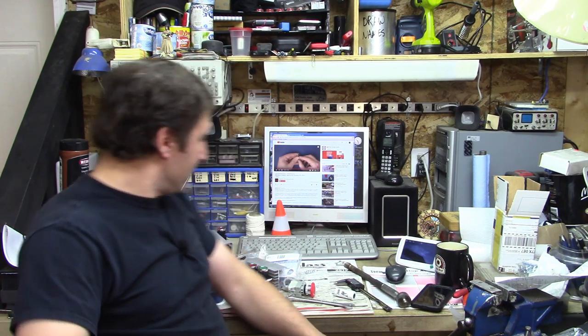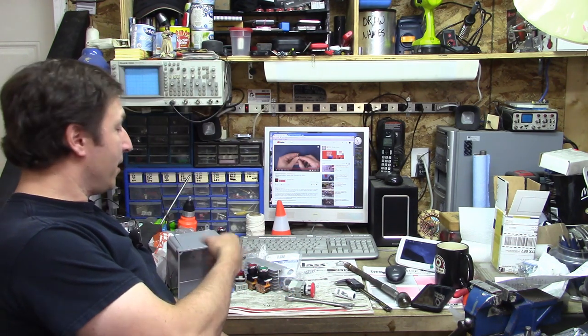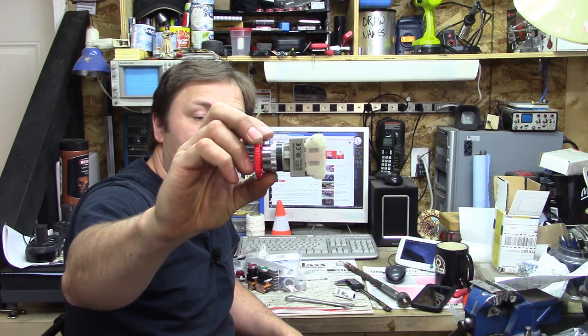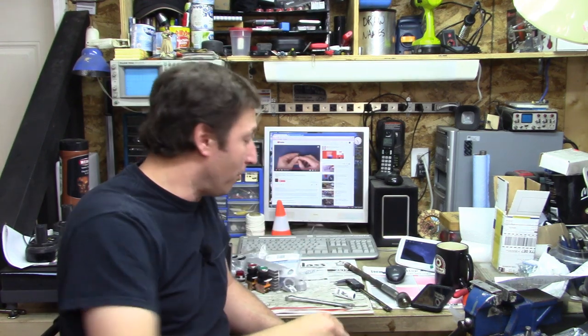What I need to do is drill some 7/8 inch holes in a plastic box. It's for the shaper — I've been getting around to finally working on the electrical system to put it together. All the parts and bits are right here. However, all the switches and stuff need a 7/8 inch or 22 millimeter hole in order to mount them in the box.